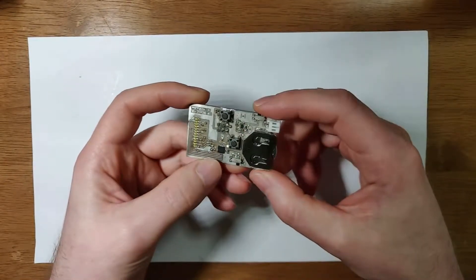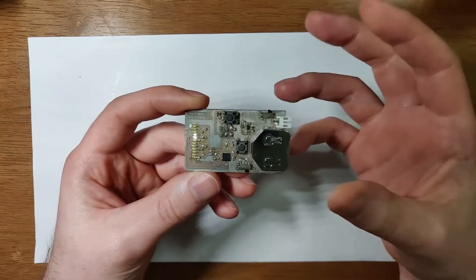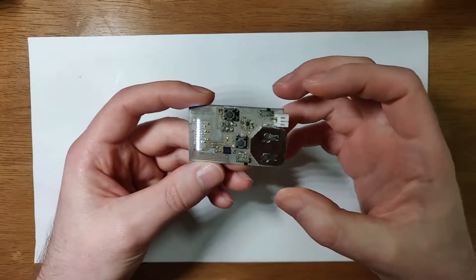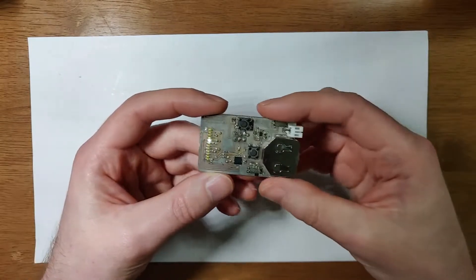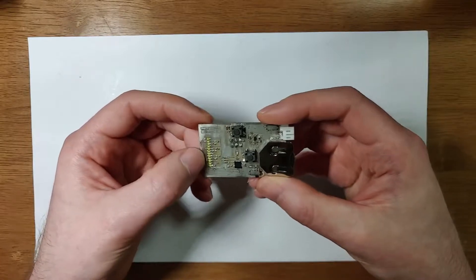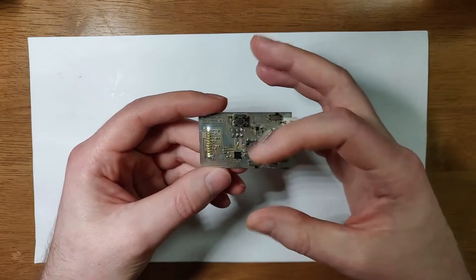It's kind of a boost converter, ATtiny 84, and an array of LEDs. As you turn it on it would show some patterns or effects based on movement, or if you added some sensors in. I liked this idea but the cost was looking a little high, the battery felt a little bit big, and the LEDs were quite bright — about half a milliamp or one milliamp each, which is actually quite a distracting light level if you're looking at somebody who has this close to their face. I probably could adjust this to have a much lower current and still have a reasonable effect.